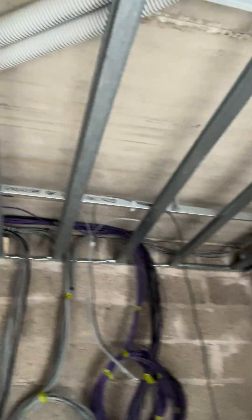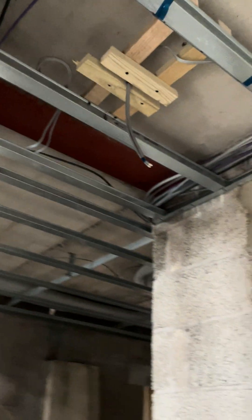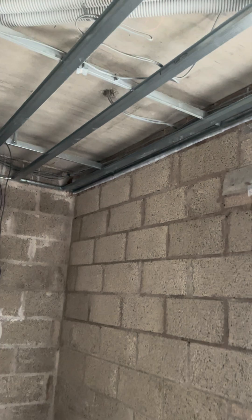It's a very brilliant product — anyone can fit it, as long as you know how to use a paintbrush. You just put it into all the awkward corners. The other detail, which is quite important and a lot of people don't do, is this house decided to use pre-cast slabs. If you imagine where your pre-cast slab goes into your wall, every single one of them there's an air gap, and if they've got open holes at the far end, cold comes in from your cavity and travels right across your slab.